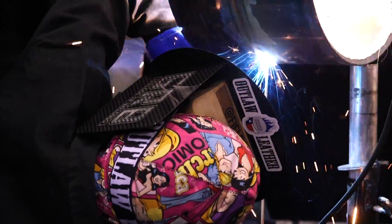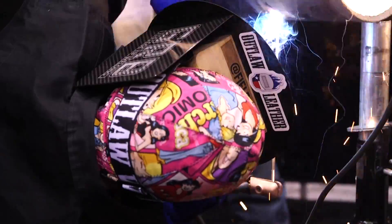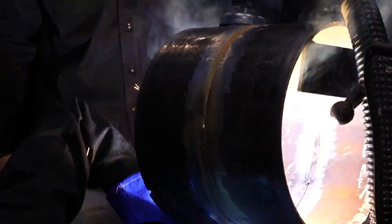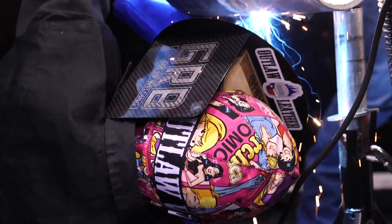I think I'm yelling either up or down to Mike here. If you look at the stinger, I'm starting to rotate it — I'm rotating the stinger away from me. That way you don't have to get your whole hand or your whole arm underneath, or get spatter or anything burnt on you. It just keeps the electrode and everything away from you, especially during hot pass, fill, and capping.